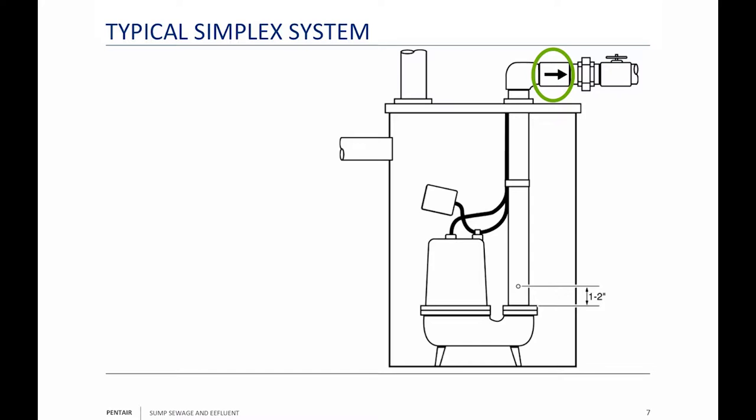Remember, a sewage pump can handle two-inch solids, and you don't want a two-inch solid to settle on your check valve in a vertical position — it wouldn't open up again, giving you a deadhead application. By putting the check valve horizontal, if the pump shuts off and something is coming up toward it, it'll either float back down or sit in the pipe and wait. We also recommend putting in a gate valve that opens all the way — either fully open so the system works automatically, or fully closed because you're working on it.